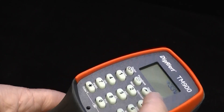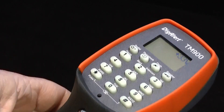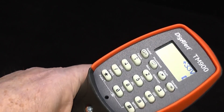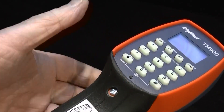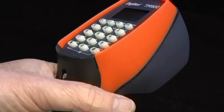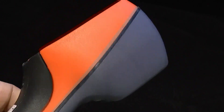Let's show you what happens with the digital service — I'll turn a simulator on. So there's actually now a hiss in the background. There's basically an out-of-band signal on the line which is triggering what we call the out-of-band detector or the digital detector on the unit. That's only active when you actually try and go off hook. If I press the talk button now, what it's doing is analyzing the line and you hear the digital warning and see the digital warning. This warning signal is basically saying there is something which is not just audio on the line. If you want to go off hook, you can — just press the talk button a second time and it goes off hook and you'd hear dial tone as normal.